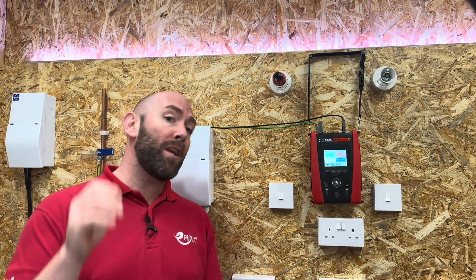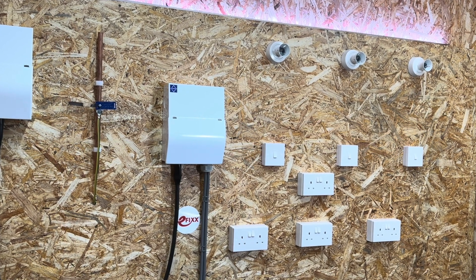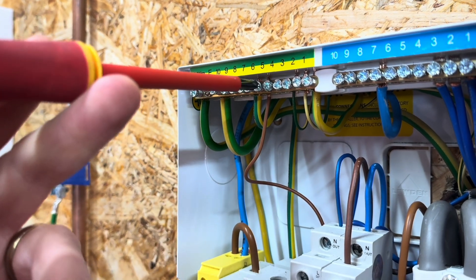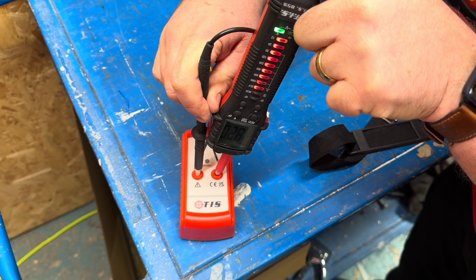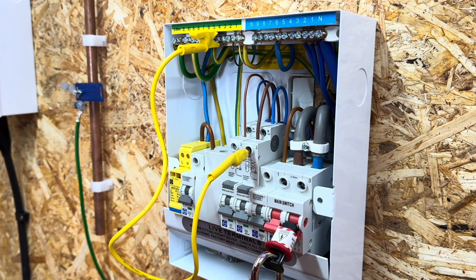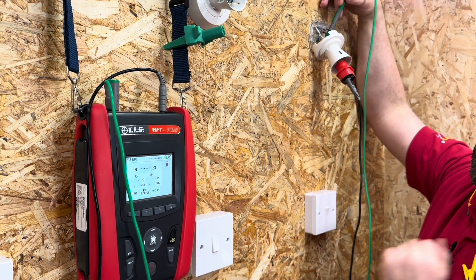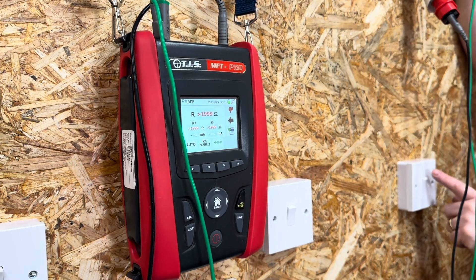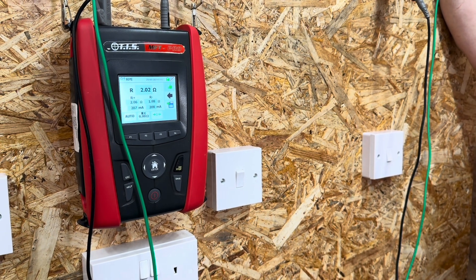This test rig may be similar to ones at your local colleges or test centres. We'll be carrying out testing of a lighting circuit, a radial socket circuit, a sub-main, and some bonding. I'm going to use test method 1 for testing the three circuits and test method 2 for testing the bonding. Figure 10.3.1 in the Onsite Guide gives a good picture of how these tests need to be carried out. Before we do anything, let's safely isolate. Testing the lighting circuit first — using a link wire, I connect onto the line conductor and put the clamp onto the earth bar. Heading over to the furthest fitting first, I put my probes onto the CPC and the switch line to test all the line conductor including the cable down to the switch.